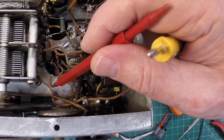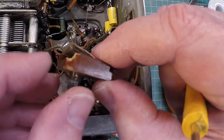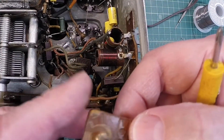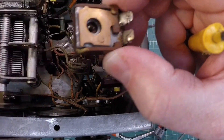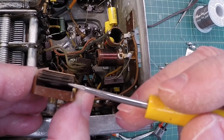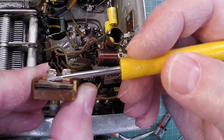You can see I've removed the padder here for the low end. It hooks to the oscillator coil here for the broadcast band and back to the band switch. Here's the padder itself — I chipped just a small piece of it away trying to get it out, it was so tight, but it's a 600 picofarad unit, also denoted on the schematic. Here's the problem though: if you look at the screw adjustment, the phenolic material that was around the top had softened up and broke loose. So the two plates — the plate on top and the plate on the bottom, separated by numerous mica pieces — I could not put enough pressure to close those, or they were intermittent in nature where they would bounce up and down and change the capacitance.